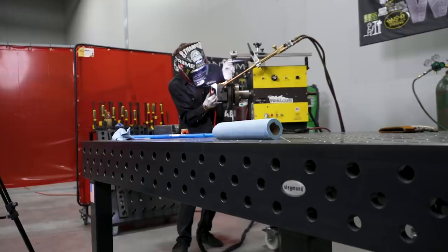The layer thickness during welding depends on the chosen welding technique. If you add material drop by drop, the layer thickness will be slightly smaller because the welding bath will drain a little more. If the Anviloy weld rod is held in the melting bath, the layer thickness will be higher. You must be careful to ensure that the melting bath flows well.